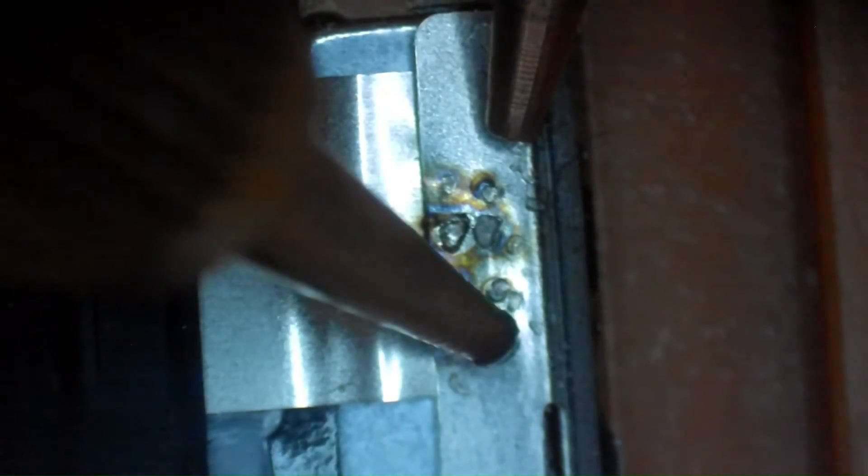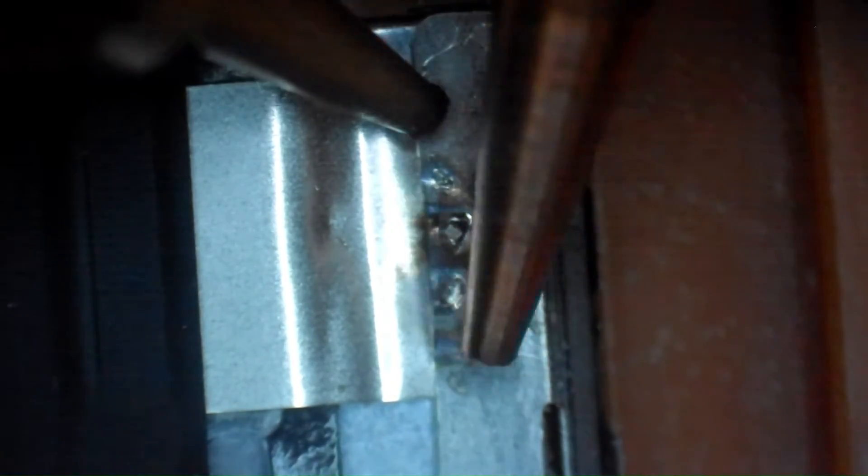Trying to push the pins hard into the BMS tabs will just create problems — it's about light pressure and making a contact point. Using the brace point and touching above each of the original four welds, I'll demonstrate a blowout in the middle to show what happens with too much spacing or too much pressure. You can see the burn-through — that's the result of too much spacing and too much pressure. To prevent that, keep welds away from the middle. Going back over the welds once or twice, creating points above and below the original welds gives four to eight secure contact points.